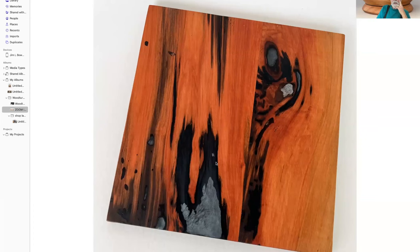The reason it caught me this time was the black epoxy where there was a lot of old rotted wood. I cleaned it out and wire brushed it down, but I had not sealed it. So when I poured the epoxy, it soaked in like crazy and created all kinds of bubbles. I was on bubble guard until it set up. Then overnight, it soaked in even more, and I had to fill in with more. So I decided to go with pewter color, and that's how I got that.